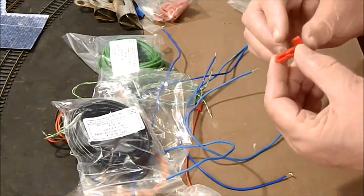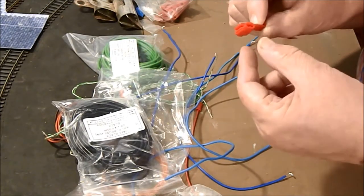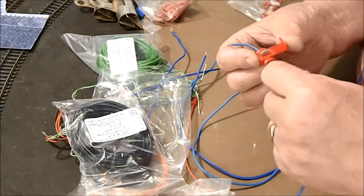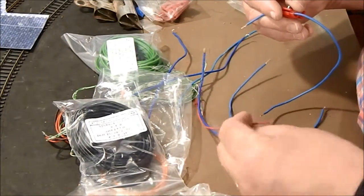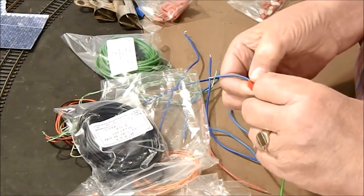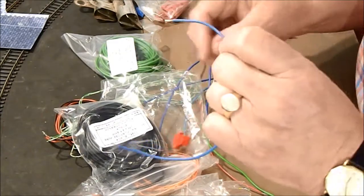Now, the normal system of joining the cables to the bus wire is this little device. Very efficient. I think they call it a suitcase. Your cable goes in, let's see if we can do it. Okay, one cable goes in all the way through. Okay, the next cable with a dead end on it, there's one, that goes in there, and to the stop you press that down with your pliers, which grips both. That comes over the top, sandwiches it together and seals it, so there's no electrical contact.